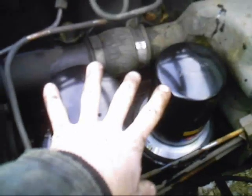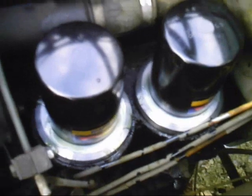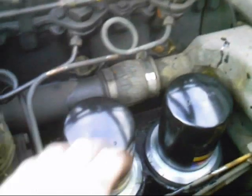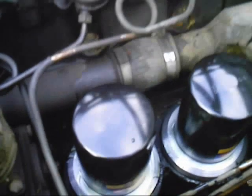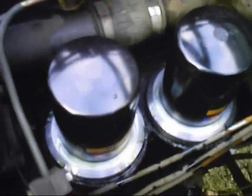Both these filters are 21 micron versus the original cartridge filters which are 32 micron — they filter the oil much better. Both the 1060s and the 1794s are rated for up to 11 gallons a minute. Due to the setup of the system here, that's 11 gallons here and 11 gallons there — 22 gallons a minute total. Your oil pump is not pumping that much oil.